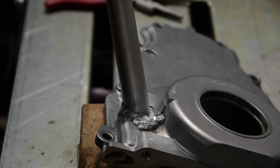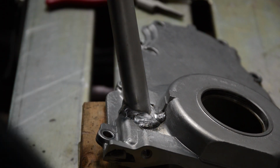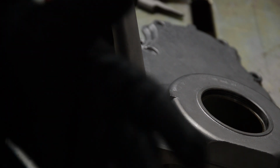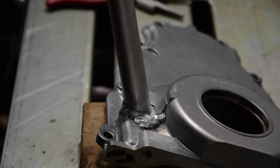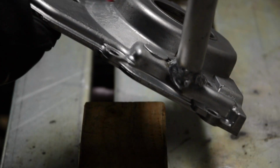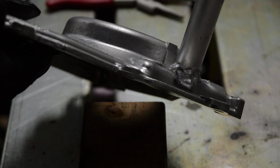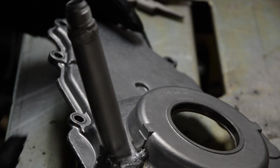All right guys, I'm going to quit while I'm ahead. It's welded, but oh my god, it was difficult for me. But at least I didn't blow through it. I didn't melt away the edge. I just had contamination. I dipped my tungsten and so forth. And it's just a tricky joint. It's not easy, that's for sure. But it's on there.